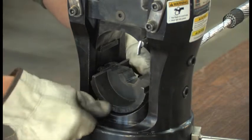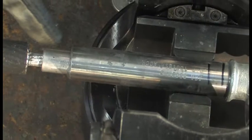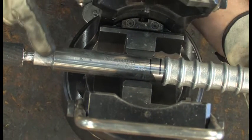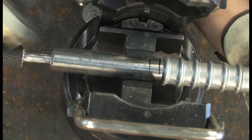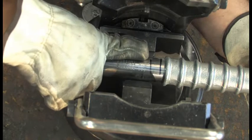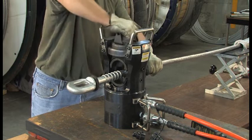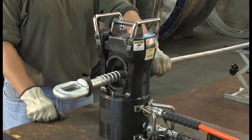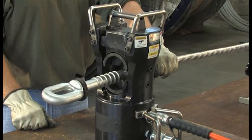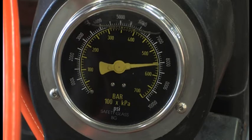To press the steel forging, first insert the required set of steel dies into the 100-ton press. Be sure the core wires are fully inserted into the steel forging. Be sure that the aluminum insert is pushed completely into the steel forging so that it is flush with the end of the steel forging. Align the start mark on the steel forging with the bite edge of the die — this is the edge of the bite formed when the forging is compressed, not the edge of the die itself. Make sure that the top hat of the 100-ton press is installed and locked into place. Be certain that the conductor is held straight and level with the press head, as this will result in a compressed forging that will not be curved or deformed. While keeping the core wires tight inside the forging, make the first compression with the 100-ton press. Make certain that the two die halves close completely and that the pump pressure reaches 10,000 PSI on each compression bite.